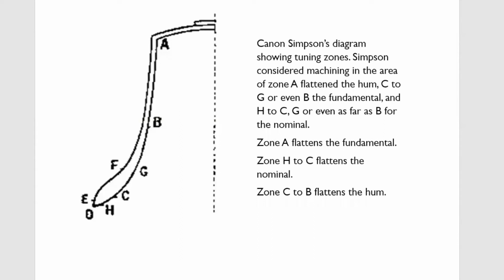And what you hear outside the tower or even in the ringing room is half the nominal. You can't pitch it, it's just not there. In a modern bell, of course, its equivalent is the fundamental because that's half the nominal frequency. But you can't pitch this strike note, this missing fundamental. And I suspect that most of the founders thought that the fundamental was self-correcting.